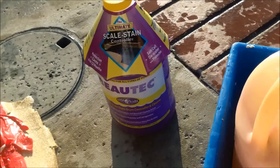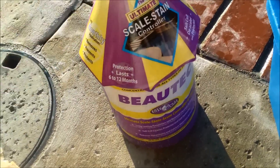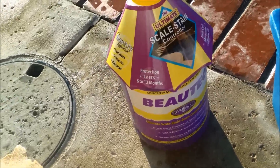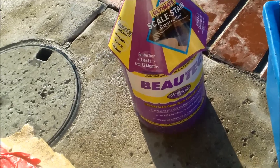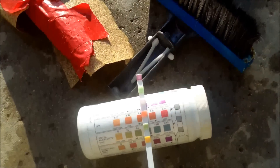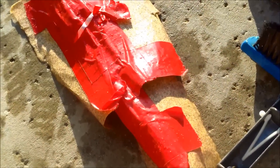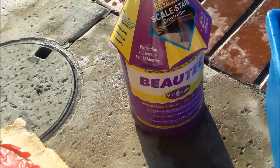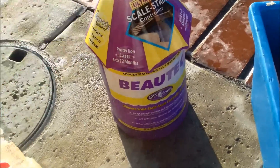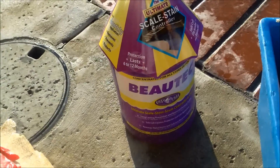Here are the key factors for success: First, add one or two 64-ounce containers of Butek initially, making sure to get the right amount in from the start — at least one full container, maybe two. Then do the maintenance dose every week. Keep your pH at 7.2 by adding muriatic acid, and keep your alkalinity around 80 — the acid will also lower the alkalinity. Use a small steel brush to brush the scale off the wall, or tape sandpaper to your brush and sand it off. Give the Butek one to two weeks to start loosening the scale. This process will take four to six weeks — brush every day or every couple of days, sand the hard areas, and keep the chemicals balanced. You'll notice the scale coming off the walls.